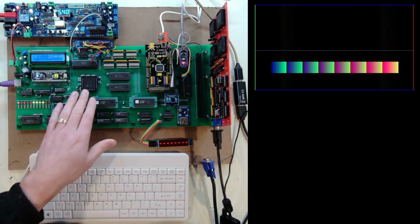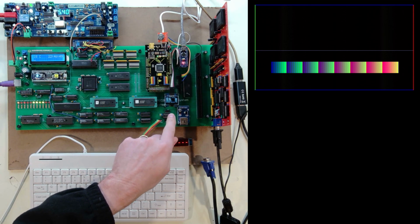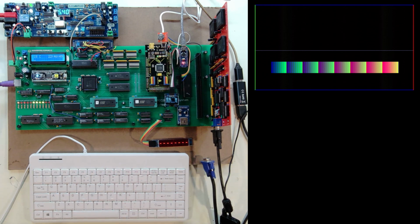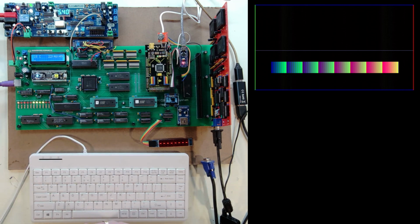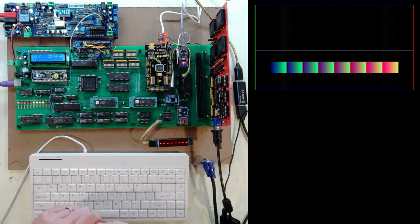Now, real quick note, at this 9 megahertz, you can't see this, but all my POST tests passed. It went through the RAM reading, writing and checking. It went through my VIA, my math coprocessor. And I'm really not doing much for PPI testing right now, but it is going through a harness at least to see if it can test the PPIs. More to come on that later if you watch my previous PPI video or POST test video.